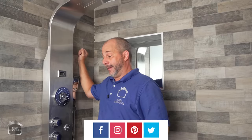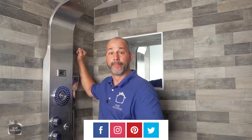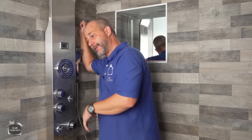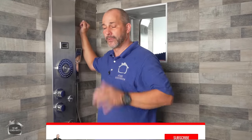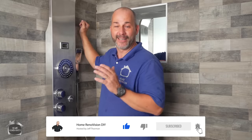Here's the secret. If you have your fan on when you're in the shower, all the moisture that goes into the air is being pulled out of the air at 110 cubic feet per minute. You're not gonna have this wall start sweating on you and dripping in behind. If you get a little bit of moisture behind that wall, you are made with tile and cement board, okay, which will not mold. If the water actually drips in the wall cavity, the house is made of wood, it can absorb a couple ounces of water every month, every day. It can absorb a lot of water and redistribute it back into the atmosphere. Relative humidity takes care of all these issues.